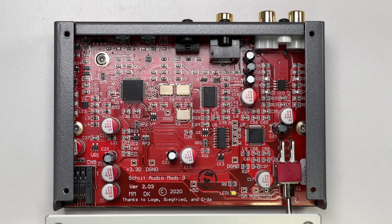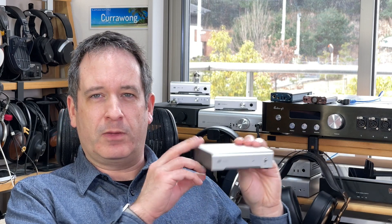There's also another feature on the back: a USB data port. We don't usually think about what goes on inside the case. Other devices have some kind of USB receiver chip inside — it could be made by VIA, or XMOS, which is very popular with high-end audiophile converters, or C Media, which is what Schiit Audio used for a while in many of their devices. The problem with using these is that you're very reliant on the drivers from one of these manufacturers. Often these chips are designed for multimedia — audio, video, and everything.